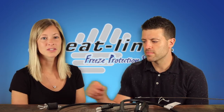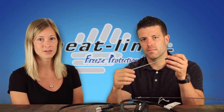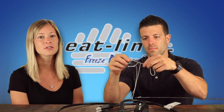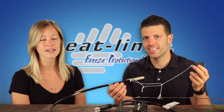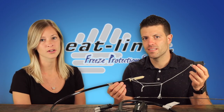Method number two: using a foam mouse. Securely tie a string to the foam mouse — or conduit piston or small piece of sponge — and use a vacuum such as a shop vac to suck the mouse through from one end to the other. Then securely fasten the pull string attached to the retro line to the string you just sucked through the pipe.